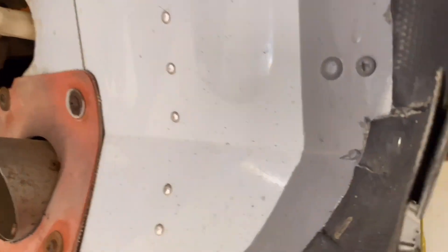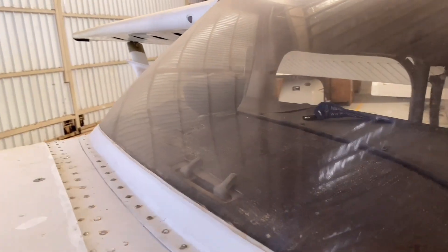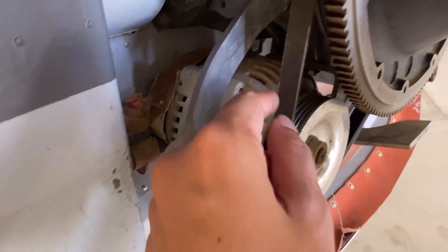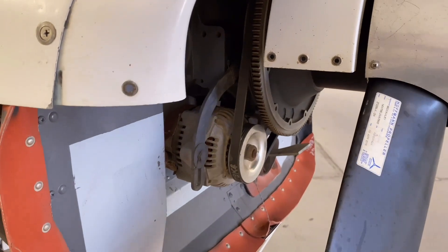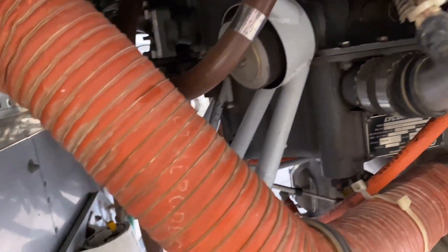This is going to be the shroud over here — it's gonna take all the cold air from outside and pass it through the shroud, and it's gonna go inside as a defroster or heating vent for your cabin. That's your alternator over here — you check the belt. It's directly connected with your propeller, so when you rotate the propeller, this thing rotates also, producing electricity.